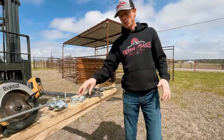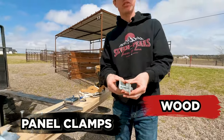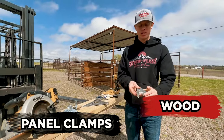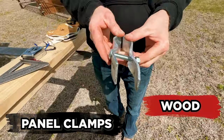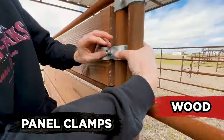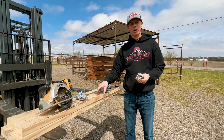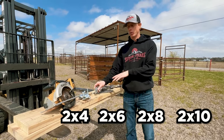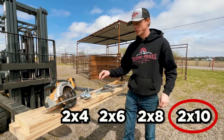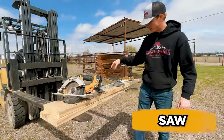The tools you need to add wood to your panels: you're going to need your wood, and you're going to need our wood panel clamps. These are different than standard panel clamps — they have the inch-and-five-eighths on one side and are flat on the other to clamp onto your wood. These work great mainly for two-by-fours, two-by-sixes, two-by-eights, and two-by-tens.